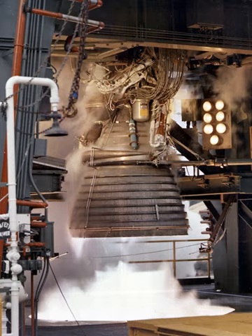The injector and oxidizer dome assembly was located at the top of the thrust chamber. The dome provided a manifold for the distribution of LOX to the injector and served as a mount for the gimbal bearing and the augmented spark igniter. The augmented spark igniter was mounted to the injector face and provided the flame to ignite the propellants in the combustion chamber. When engine start was initiated, the spark exciters energized two spark plugs mounted in the side of the combustion chamber. Simultaneously, the control system started the initial flow of oxidizer and fuel to the spark igniter, and as they entered the ASI combustion chamber, they mixed and were ignited, with proper ignition being monitored by an ignition monitor.